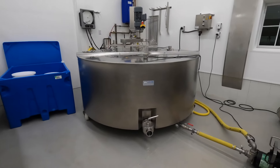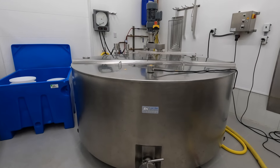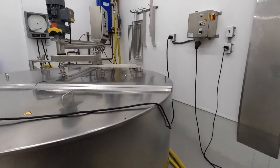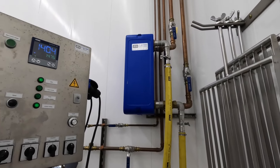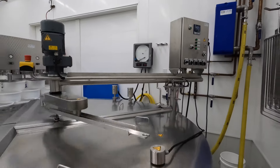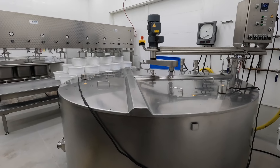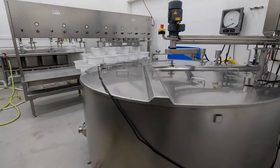It's the next morning here back at the creamery. They've got the pump running. There's a jacket on the outside of this cheese vat and they pump hot water through that jacket to heat the milk up. That water is also pumped through this plate cooler up here, which is fed with glycol from a boiler in the mechanical room. It's just about up to temperature.